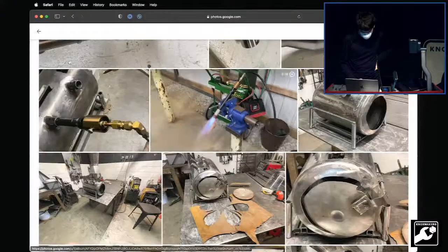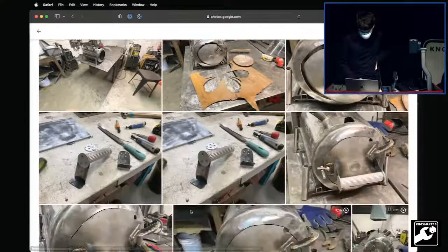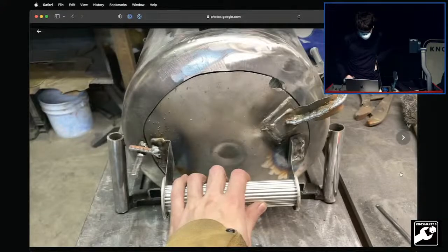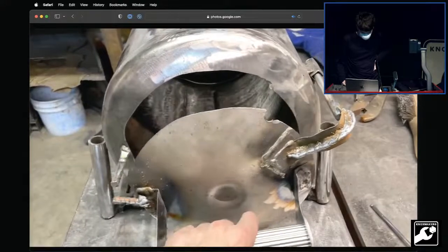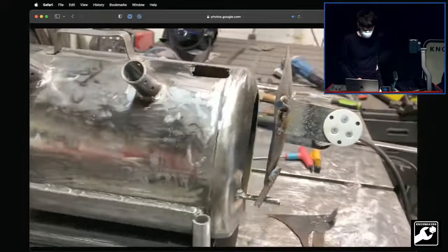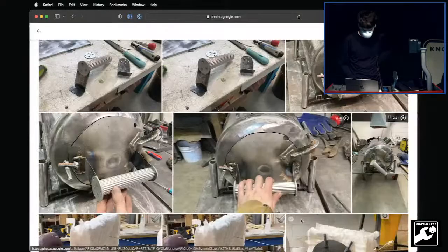And then the rest was just the finishing touches, like, all right, we've got to figure out the details of how we get a door on this thing. And did that and put a handle on there, took some sheet metal, punched some holes in it, welded it on, and then you end up with something like this for the door that just pulls straight out. And then you can let it swing low or prop it up a little bit and put in work that doesn't need it fully open, so you reflect more heat back in. And then it can pull out, so that way the insulation can clear before it swings out of the way. Or you can just swing it completely out of the way and open it fully up.